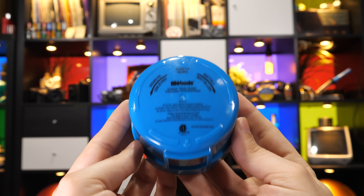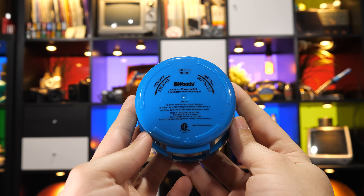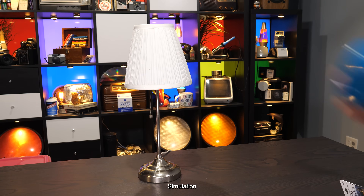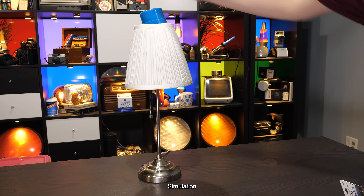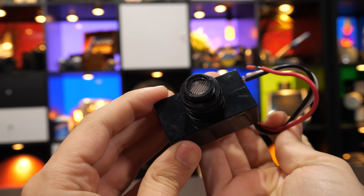This circuit is really quite elegant, and it works just fine for controlling a tiny light bulb. But it's not enough to control a street light, which might have a light bulb like this that draws a thousand watts. For that, you're gonna need something a lot more robust, like the thing I showed you at the beginning. This light control can interrupt the full 15 amps of a standard US lighting circuit, and is even rated for up to 277 volts. This style, with its twist-lock plug, is commonly used atop individual light fixtures for easy replacement, but they're also available in little wire-in modules like this.